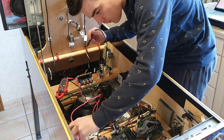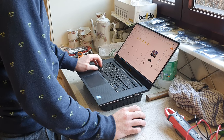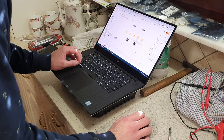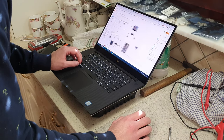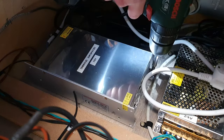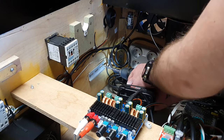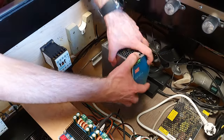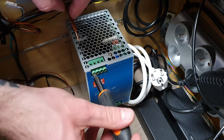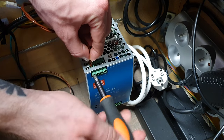I start by verifying all the connections by measuring continuity with my multimeter, then draw each connection I test in a diagram on my laptop. This really takes a lot of time, as there are a lot of devices and wires in the cabinet. Slowly but surely, I map out every single connection to every single device. In the end, I could not find a problem with my wiring, so I decided to follow my suspicion and throw out the cheap Chinese 48V power supply. I remove it from the cabinet and install a DIN rail in its place, then buy a replacement power supply from a well-known brand that can definitely be trusted. I hook it into the DIN rail and connect the wires like before. Luckily, this ended up fixing all the issues — they say to never cheap out on a power supply, and I should have listened.